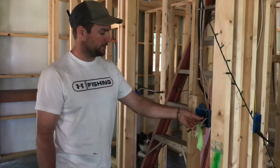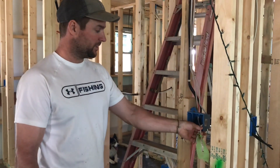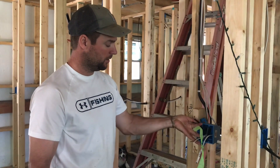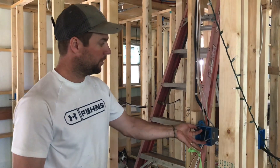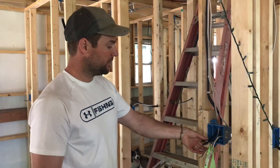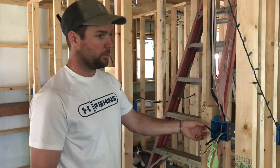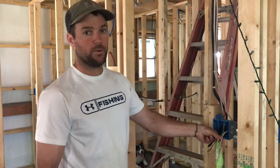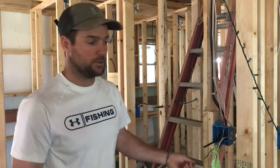The same on the lights — we have the Romex here but we're not going to use it. It's just going to get rolled up in the box. We'll be using these and run them straight off 12 volt. We'll get light fixtures that take a bulb, put a 12-volt bulb in it, and we'll be done. And if we ever want to switch it over, we switch the wires, switch the bulbs, use the same light fixture, and we're ready to go.